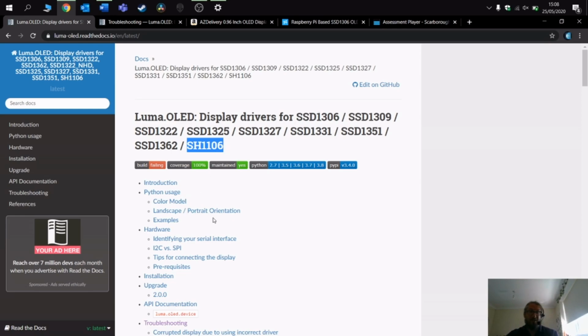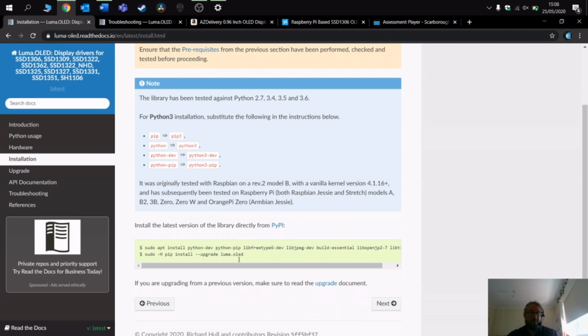Now, all is not lost because you can still use it to display images. If you go to this website, links in the description below, go to installation, and all you need to do is install using these two commands. If you're using Python 3, which most of us probably are, then obviously use pip3 and python3: just before each Python, put a 3 in, and that will install the correct libraries and code to run your screen.